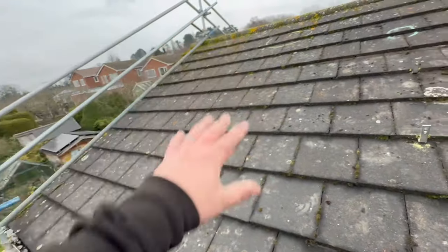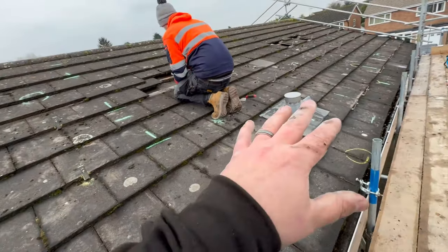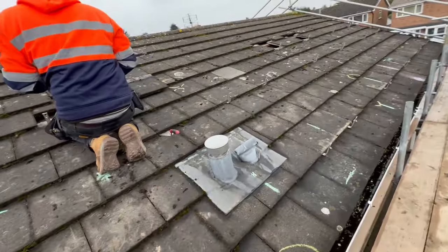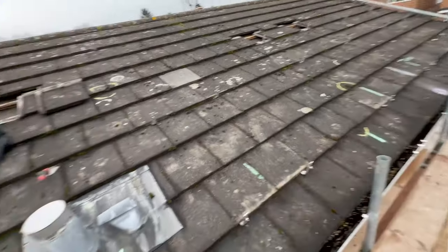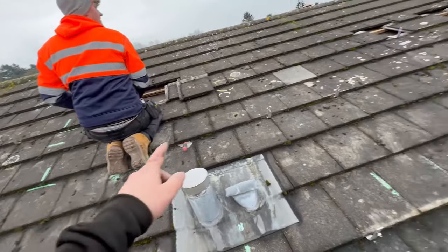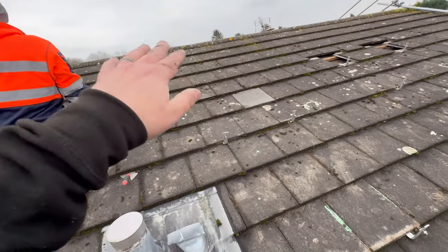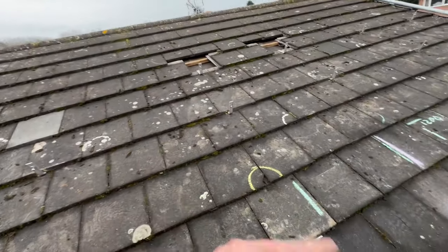This side is going to be empty space — this is the north-west side. There is room for another four panels, however we're going to stick with the 14 on here. The sun kind of sets over in that corner and with the client's budget, we're trying to spread the panels to get the best return. We've got nine hooks to get around an obstacle for our seven panels on one row, and eight hooks on the other row for seven panels. That'll be repeated up the roof. We put one test hook in the top row just to see if we can get the tiles out easily without disturbing the ridge, which we can. Always best to check that before you start setting your rails, because if that one doesn't go in, none of the rest works.